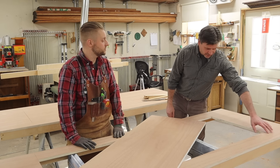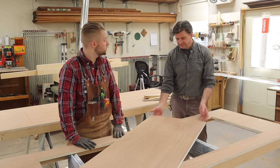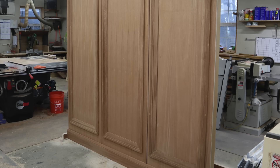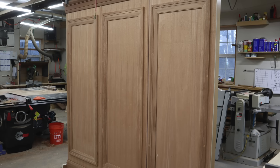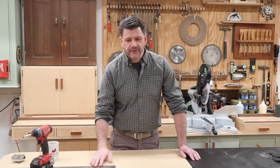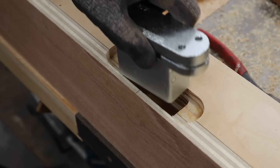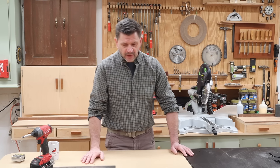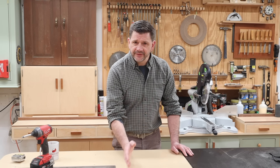It's smooth. You'll be adding some molding here next and you're going to have to beef up this plywood so you can attach the hinge. Right, so we'll turn these into inch-and-three-quarter doors and then we'll have enough meat there to get these 518 hinges in. Thanks Jeff. Thanks John. It's always good to see the guys over at Green Street Joinery. I'll be going back there in a few days once the wall is completely finished and we'll be making a video about the SOS 518 secret door hinge. I was pretty excited to learn more about the Makita track saw — it's definitely on my list for another tool in the shop.